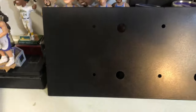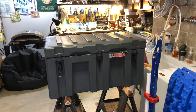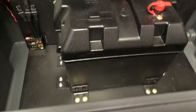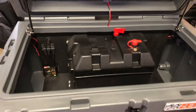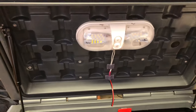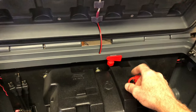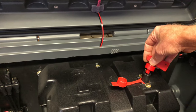Inside the box all the holes are drilled and grommets are in and ready to go. This is the back wall panel - no grommets. We're getting close to being wrapped up on the equipment box project. I've just about got everything wrapped up internally. I've got the plates mounted inside, the battery box mounted to the plate. There's a light that's going to be hardwired directly into the battery - not running through the inverter or the trigger wireless control switch. I put a power disconnect switch here.